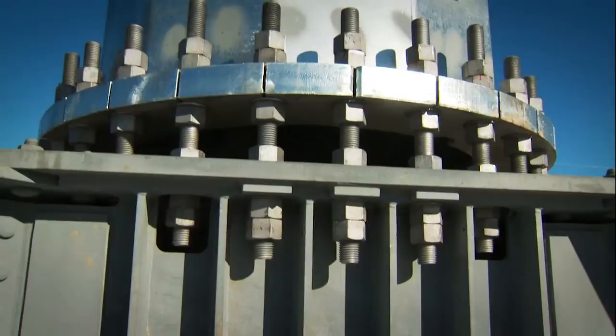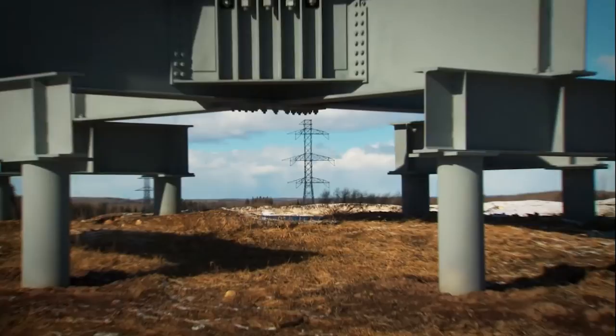Given the remoteness of the area, what they were looking for was an all-steel design with screw piles and then steel grillage on top. In a nutshell, the design challenge was the classic fitting a round peg in a square hole — steel framing a foundation for something that lends itself more easily to a concrete system. So challenges were there in the design as well as in the fit-up.